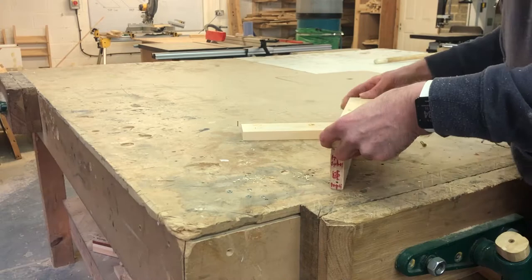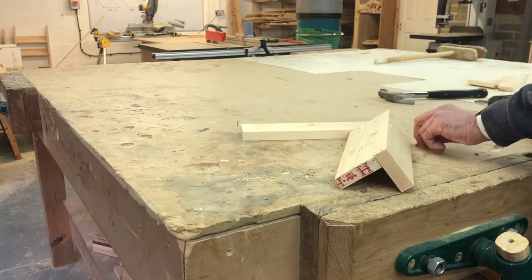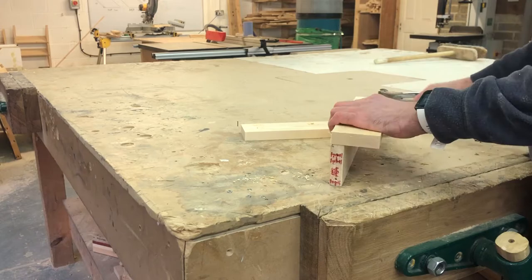As you can see I've sped this video up — I don't normally go this fast, well, a little bit slower. You want to screw both sides to the bottom timber, using some thin screws that need to go into the bottom piece, probably about 20mm.